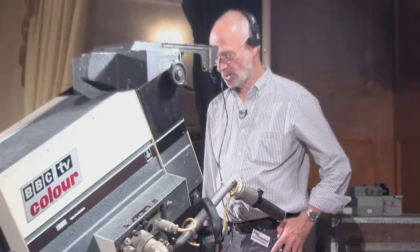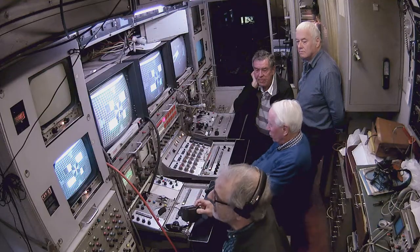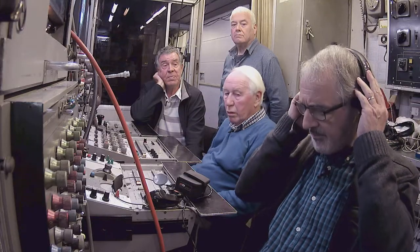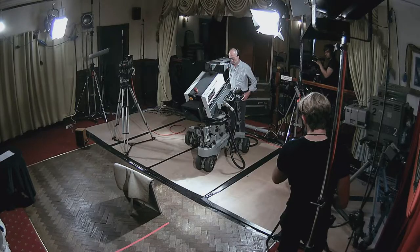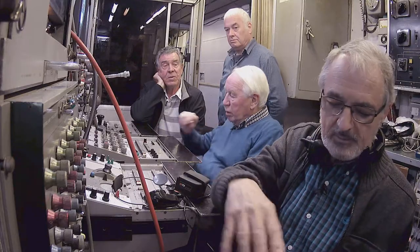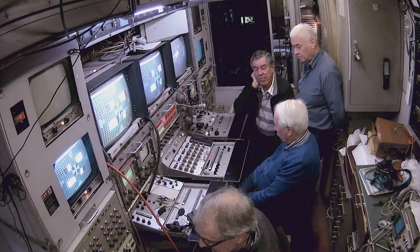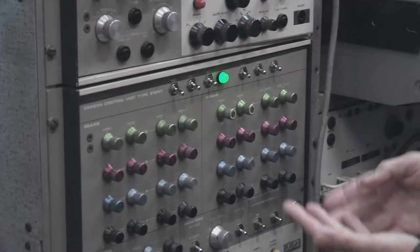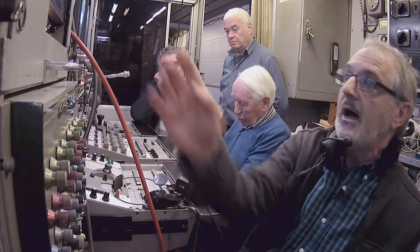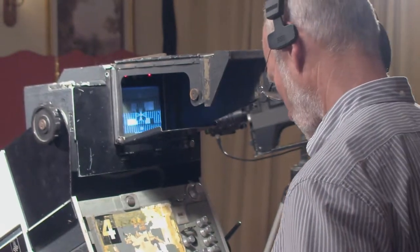Hi Robby, can you hear me? Hi John, yeah, on the camera. Great, so we've got the camera on the chart. In this case we've got four tubes, but on those cameras we have three tubes. So we'll just demonstrate on the red in this case. We've got red, green and blue, and we've also got a Y channel, and this chart will show up all the errors better than anything else.